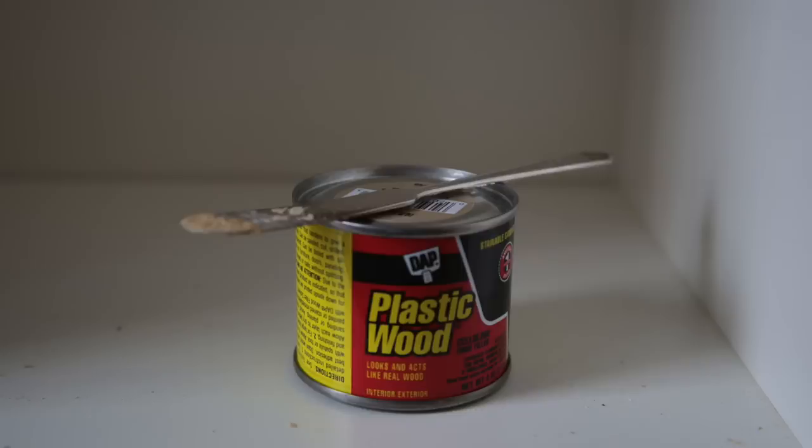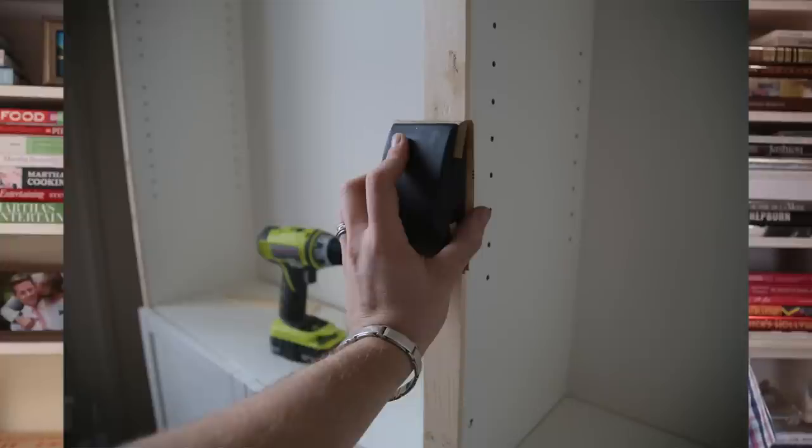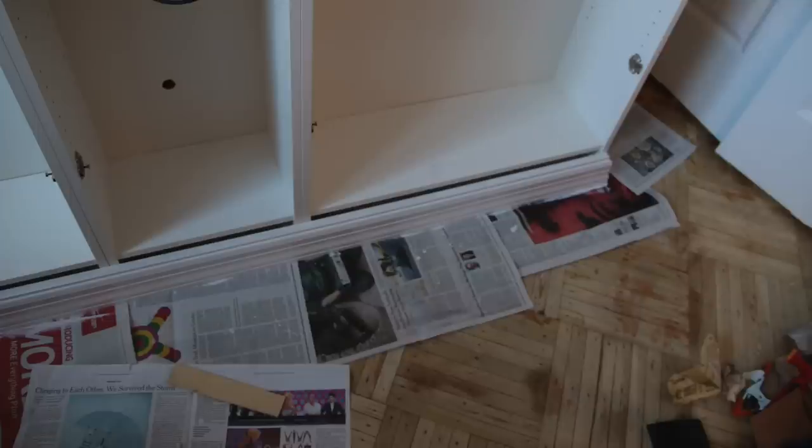I added caulking right down the seam so it completely disappeared. Next time I won't make so much of a mess with the hole filler because it gets really hard once it dries and it was hard to sand off, but I sanded it nice and smooth and that made all the holes disappear. Last but certainly not least, I painted all of the trim and the crown molding. I took one of the small shelves to a paint store and had them match the color, then got paint and primer in one and did the whole thing in one coat.